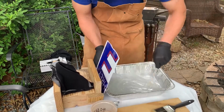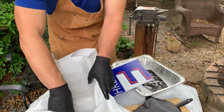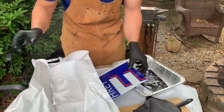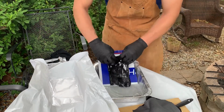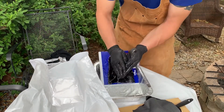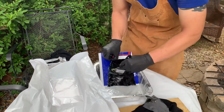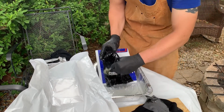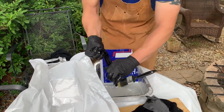On the bottle, the instructions say something more like 10 minutes, but you need to remember something. Those instructions are directed at the people that are making $5,000 conference room tables, and they're having to allow enough time for all the foamy little air bubbles to rise up out of their mixture. The 10-minute thing does not apply to us knife makers. Bubbles and foam do not matter to those who are squeegeeing out their layers and furthermore applying a weighted press to their project.